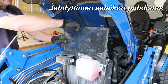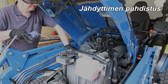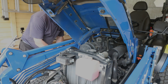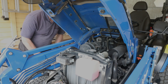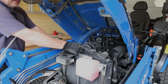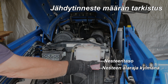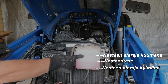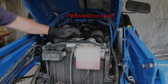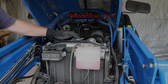Cleaning the radiator grille and the cooler. Check the coolant level — lower limit when cold and when hot. When the engine is running warm, do not open the cap of the radiator system. When hot, the cooler is pressurized and opening the cap involves the risk of burns.